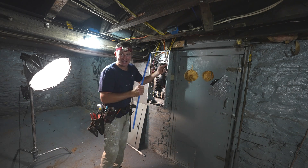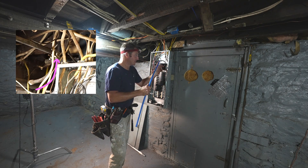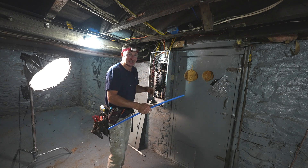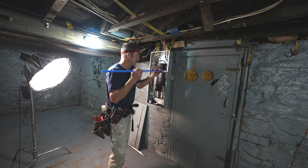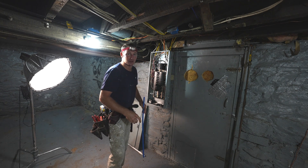Take off the box and pay attention to how it's grounded. Most of the time, in older homes, they used to ground everything to the main water supply. So pay attention to where that's at and make sure that you get your electrical panel grounded to the meter side of it.